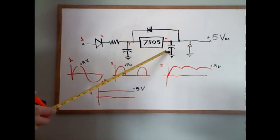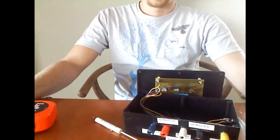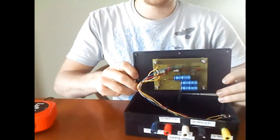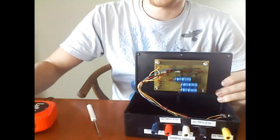We also have another filter capacitor here because even though the signal is rectified, it's not 100% — there's still a very small, subtle ripple. Then your output is 5 volts DC. I know I didn't cover everything, so if you have any questions about how this circuit works, post them in the comments below and I'll try to answer them as best as I can. Thanks for watching, have yourself a great day.